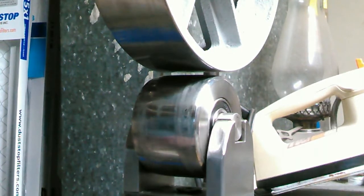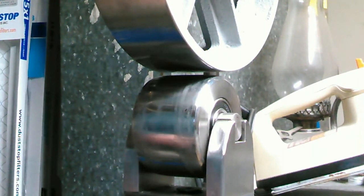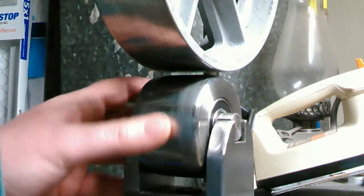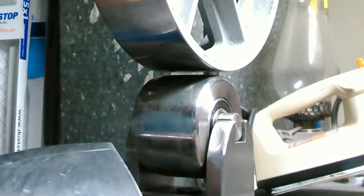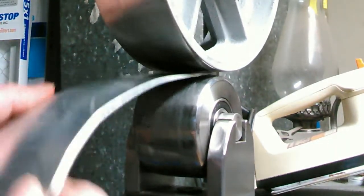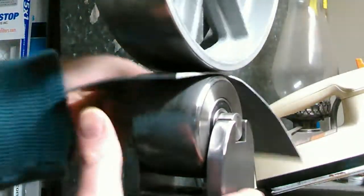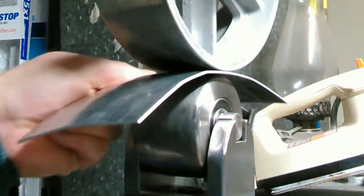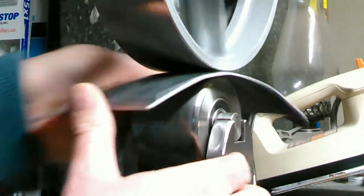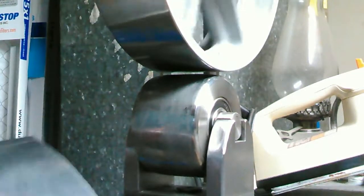We've got a fairly good-sized project that we're going to be working on over the next couple of weeks, probably, because I don't have time to do it all very fast. This is my full-sized English wheel. If you've got a part like this, and here I put a couple of big hammer blows into it, this wheel has no problem smoothing those out. It's got plenty of rigidity and stiffness. You just run it through, and you keep increasing the pressure as you flatten down that lump. Before long, you've gotten rid of that walnut, what they're called.